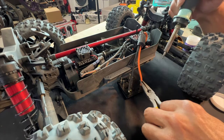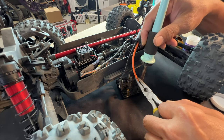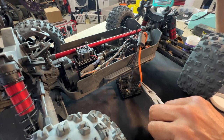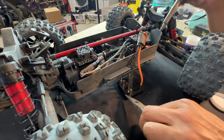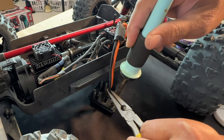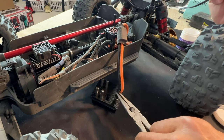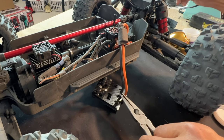Do a test fit to make sure it fits. Then melt the inside solder — heat up that bullet connector, give it a few seconds, and once it's properly liquefied push the wire in. That will form a good bond, melting the solder in the wire and securing the wire into the connector. Before, I was so scared of EC5, but it's really just pre-melting it and sticking it in quickly, and that forms a solid bond.